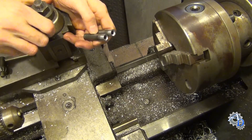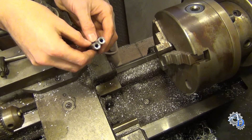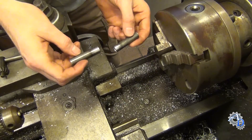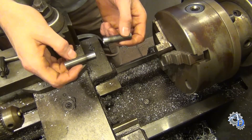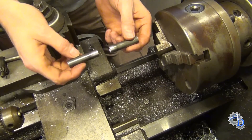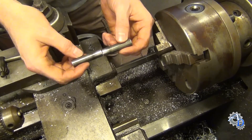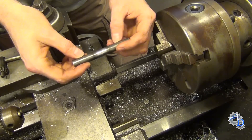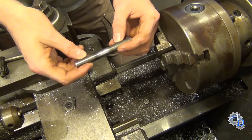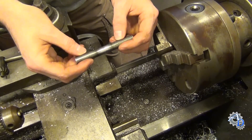I've been wanting to do a video on friction welding for quite a while. If you're not familiar with the term, unlike other forms of welding where you might use a flame or electrical resistance, with friction welding they take two pieces — it's more suited for round pieces — and spin them in opposite directions at high speed, until the point of contact gets so hot from friction that it melts.